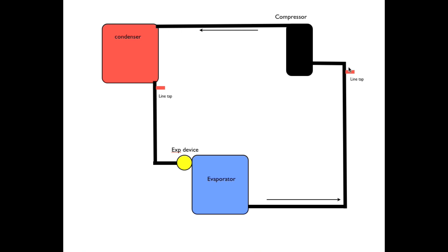Fairly simple. The first evacuation, you just pull down as best you can with both sides. For the second and third evacuations, I push in the low side and pull out the high. This is a way I developed — I don't know that any manufacturers tell you to do it this way, but this seems to me to be the best way. I'll have a practical on this and how to do the evacuation coming up in a couple of days.